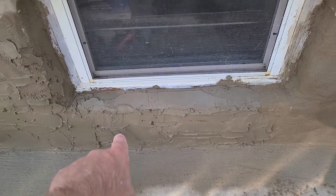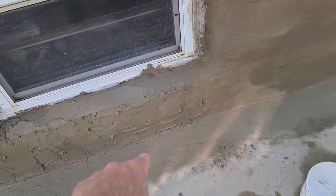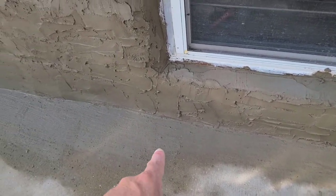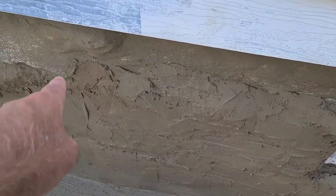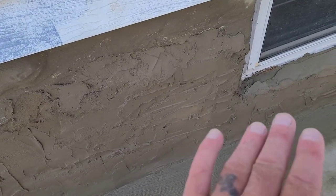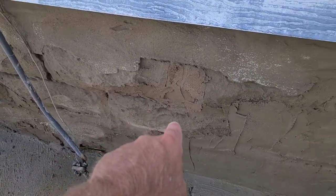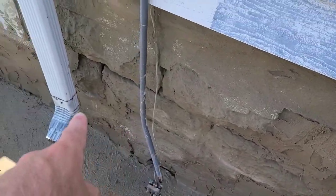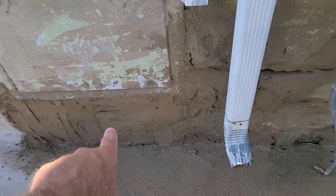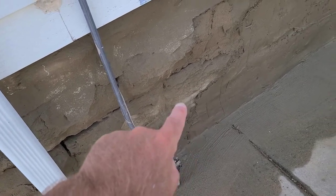This part got kind of rough - my knees and back are an ache so it's a bit sloppy. What I'll actually do is take the broom in about two minutes, wet it, and kind of knock those high spots off - kind of cheating. I'm done up to about right here. I'll take the broom and knock the high spots off, let it dry 10 to 15 minutes, then go back with the sponge. This part here I still have to go over with the layer of lighter mortar all the way up to here. There was a spot that needed to be built out quite a bit.